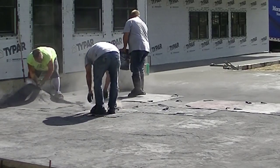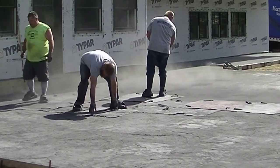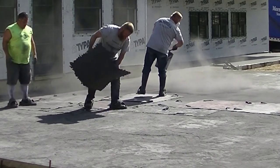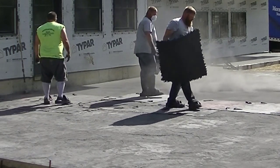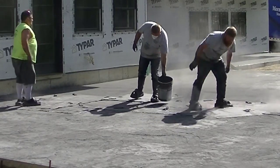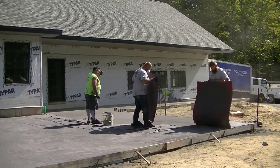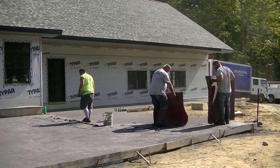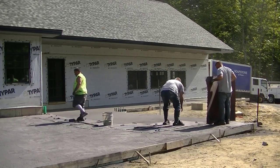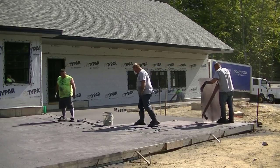You can see over there by that truck on the driveway there's a part of the patio that's been in the sun for a while. At some point you're going to see where I had to move over to that corner and start stamping before these guys got there. That's just the beauty of using these stamps versus a different type like an ashlar slate — that would have been difficult to do because of how it locks together and how all the patterns meet up.